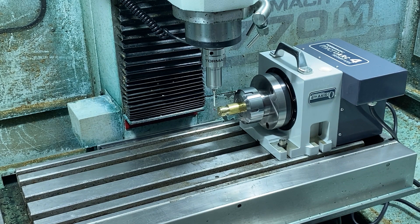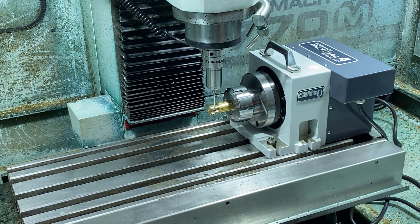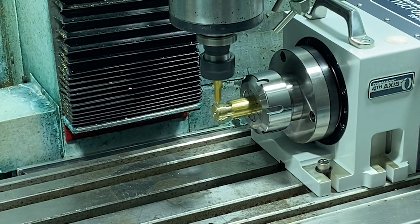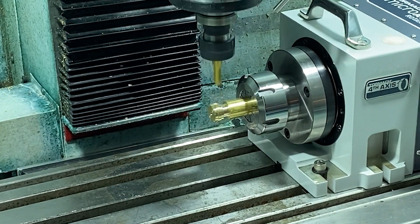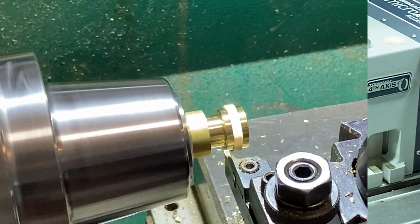What I need to do now is move it over to the fourth axis. Here I'm using a probe to find the center. You'll see it's a very quick operation on this Tormach. The picture's not great, but this is going and putting in the grooves along the grip for this weight. You can see it rotating — I put 50 grooves along it.